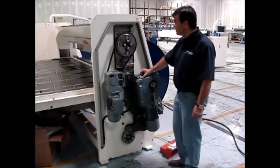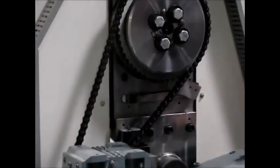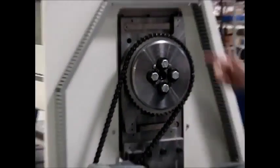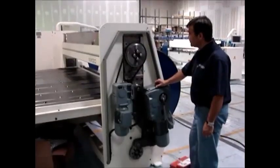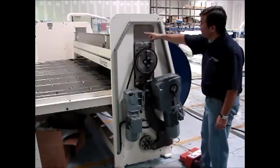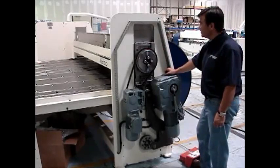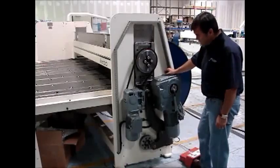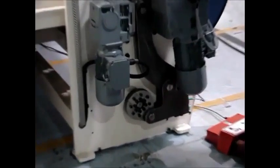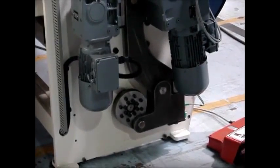What I'll do now is rotate the combi beam. You can see it locking in. Back, clutch hits, and then you're locked in. Now you can see the upper beam movement. We use an O-frame design, and we give it 20 inches, half a meter, in length. That gives it a nice parallel guiding. Then you can see the actual eccentric. And when I hit the foot pedal again, you see the eccentric's not moving a lot. And that's what gives it all our power.